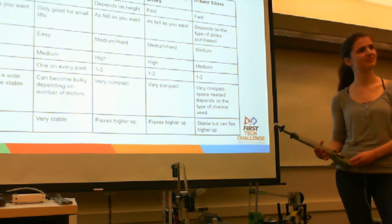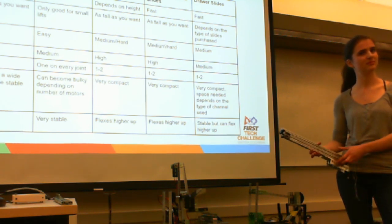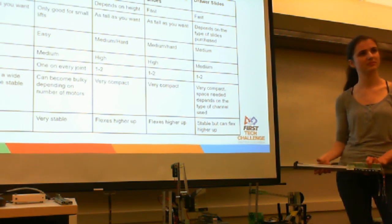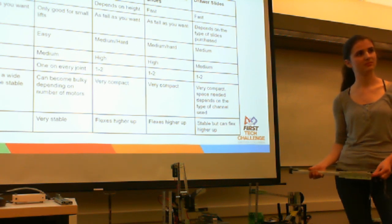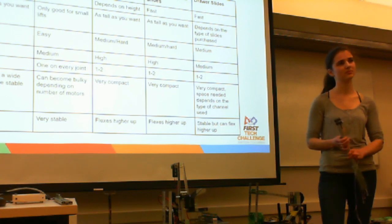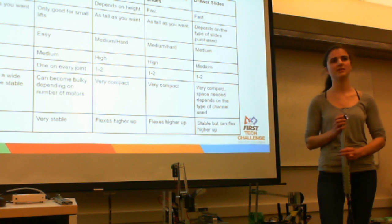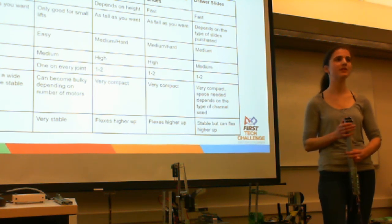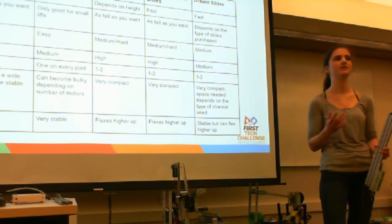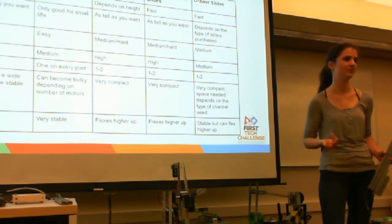If you can get thin steel cable wire, or forms of metal wire that are actually designed to bend and go around pulleys. They're a little harder to source, but if you can actually find a good one, that's very nice. Also, if you are using the continuous string configuration, it's not as important whether it stretches or not, because it's all one string, so if it stretches, you're just going to have to wind it up a bit more.